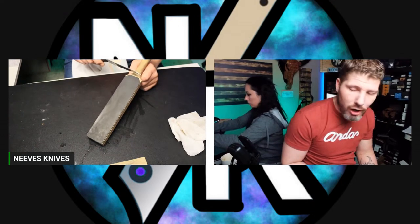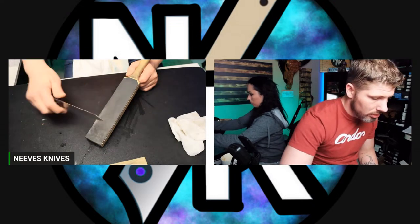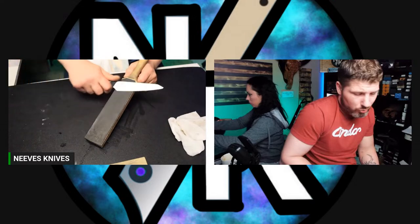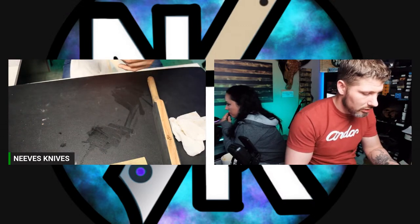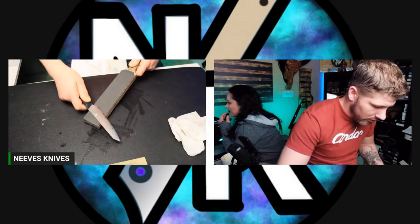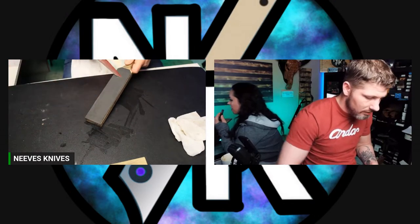Wood is very soft, especially compared to steel. All it's going to do is remove the burr. It's not going to hurt your edge at all. Just make sure it's kind of softer wood, you know, pine or something. Really doesn't matter. I do have a little tiny bit right there. Like I said, this is a little bit of a softer steel, so the burr is going to be a little bit more stubborn than with a harder steel.